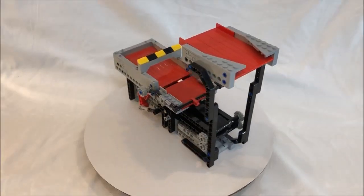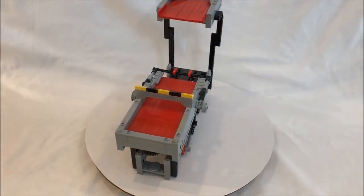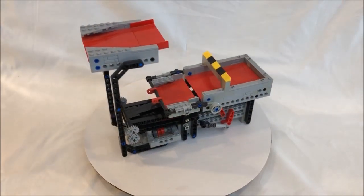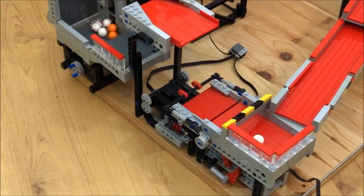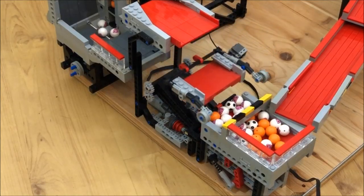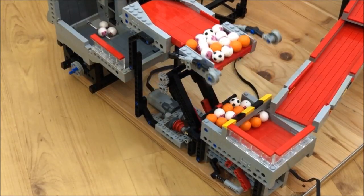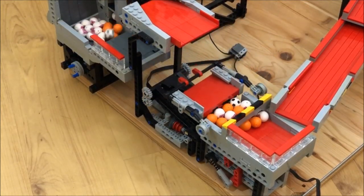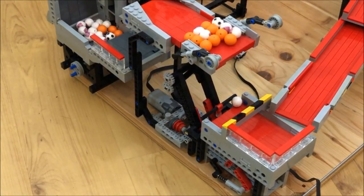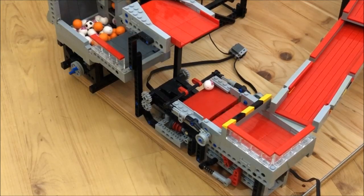The knot scissor lift uses two interconnected 4-bar linkages to push balls straight up. As an older design, the module has simple gates rather than the limited gate of the mover and relies on the size of the lift to control ball flow. It has a very high theoretical and practical throughput, but a full lift seems almost too heavy for the mechanism to raise properly, and others who have built copies from my instructions have needed to make modifications to get it to work.